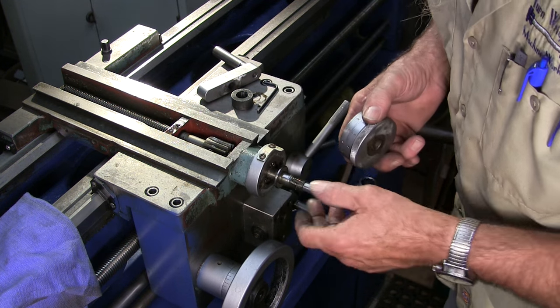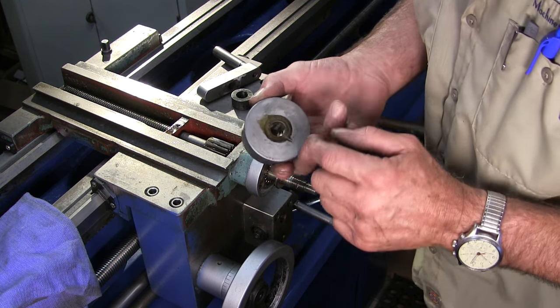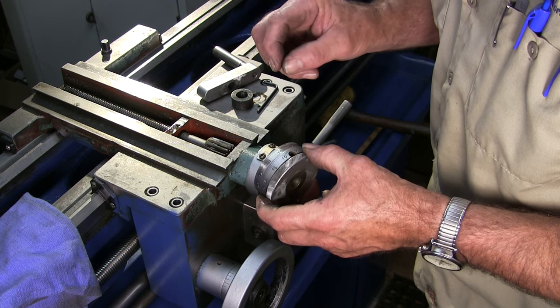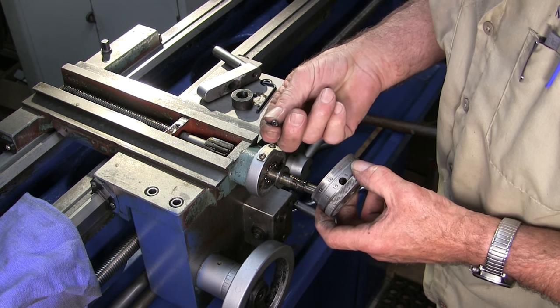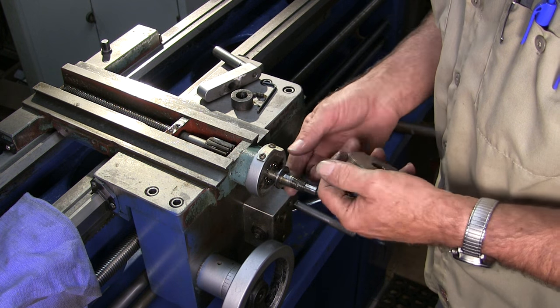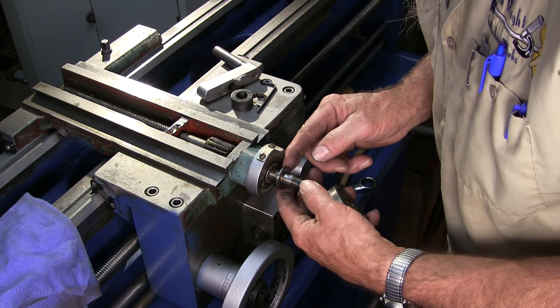Look at that chunk of metal there — this is stuck where this normally rides. I think I'm going to put a little piece of brass slug right below that set screw so that the dog point doesn't dig in there. I want to be able to move this easily and adjust it, and I don't want to wear a track in the new shaft that I'm going to make.